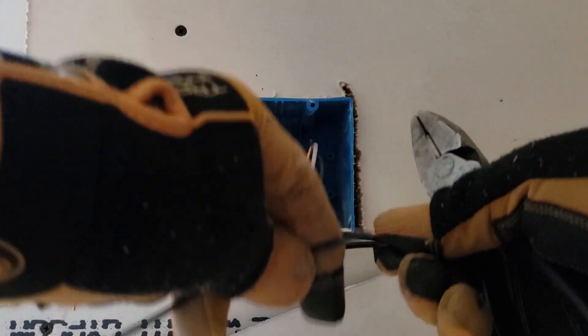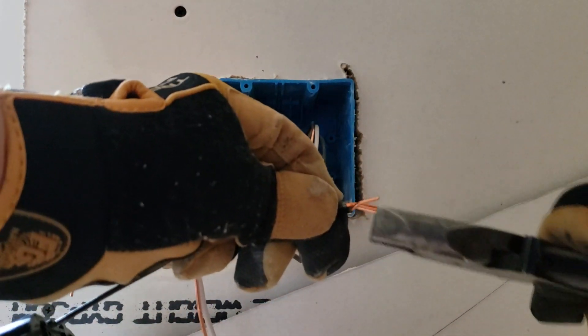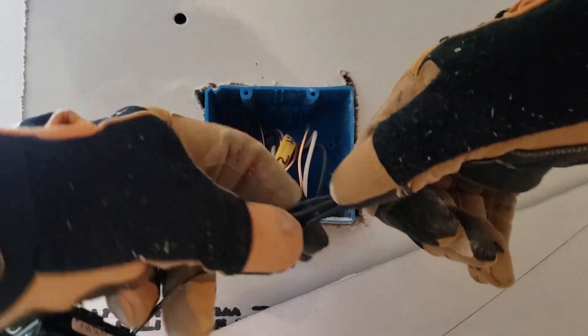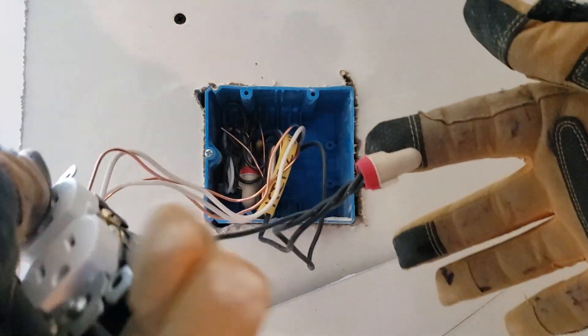You can do this with two or three wires. Put all the wires together and pre-twist them with your lineman's pliers before you put your wire nut on. In my experience, if you just put the wire nut on without twisting them, you can get loose connections. The wire can pull out of that connection a couple years down the road and you have issues.